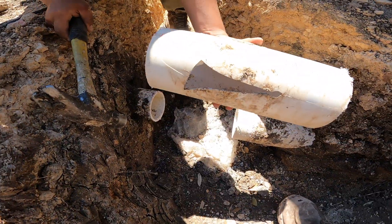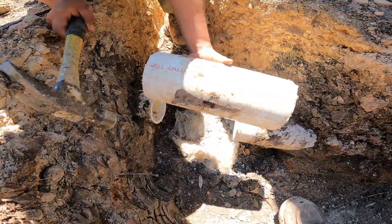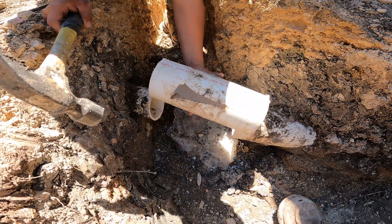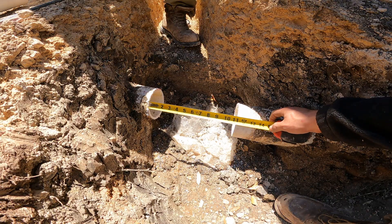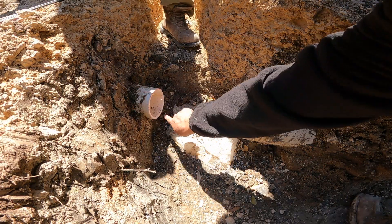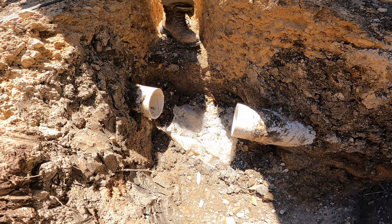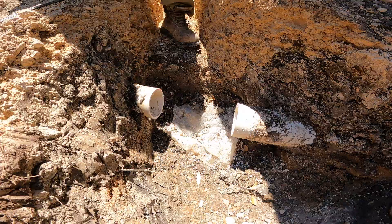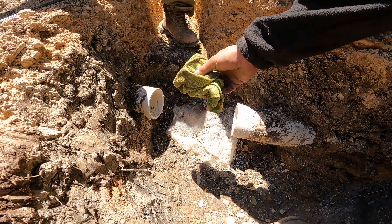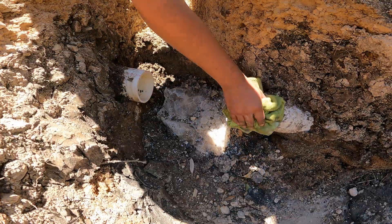As you can see, the pipe was cracked due to trenching — probably got cracked with a pick or something. Get a measurement of the pipe and clean it very well. You don't need anything on the pipe when putting the couplings on, otherwise it's a potential leak. You can use a rag and spray it down.